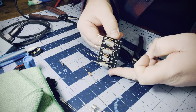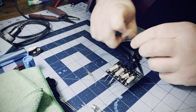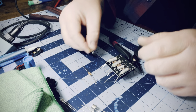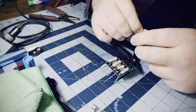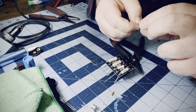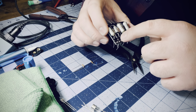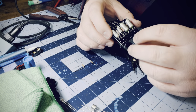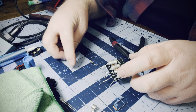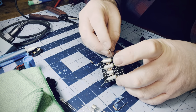We've got pretty much most of the components on there. We've got to do the transistors next. This is a mod that I do to increase the leakage of Q1 — this will go under the board. One of these would normally be kind of flying off of the circuit board going to the pot, but there's a little trace here that allows me to just mount it directly to the board and the trace will go to the pot. This one is for the LED — it fits in right there. So the LED is mounted right to the board, and so is the resistor that holds down some of the current.